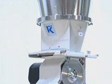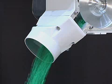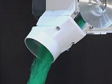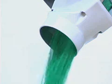This feeder does not use the usual screws, belts, or vibratory trays to convey the material. Rather, it's the first of its kind in the process industries to utilize positive displacement action for volumetric and gravimetric feeding of free-flowing materials such as pellets, granules, flakes, powders, and friable products.